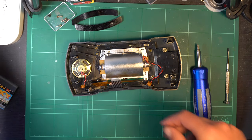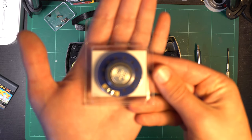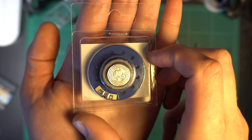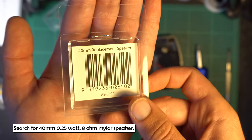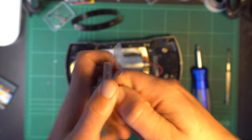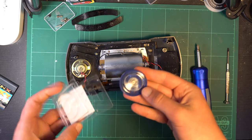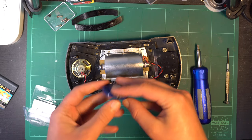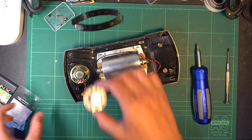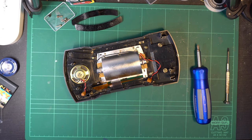Here's the replacement. If you're in Australia or New Zealand, this can be found from Jaycar Electronics. It's a very basic 40mm wide speaker, and I'm sure it can be found online easily as well. It should be noted that this replacement is only 8 ohms, while the original is 16. But from my very limited research, it doesn't seem like this will be a problem. The original might go a little bit louder, but since it's blown anyway and I can't seem to find a 16 ohm 40mm replacement, this one will have to do.